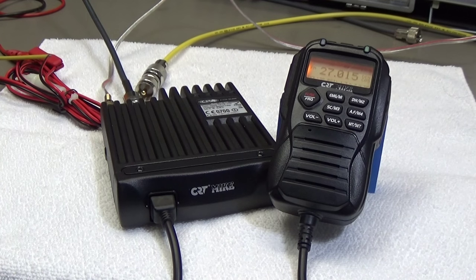Secondly, our harmonic issue, that this CRT and as well the Cobra, these both radios do not fulfill the requirements, and from my point of view, the CE labeling is at minimum questionable, so I do not really know why it is so. But to say it very clearly, when you operate this radio, when you have bought it and you are using it on a daily basis, you will not recognize that this radio does send out a too high harmonic level.